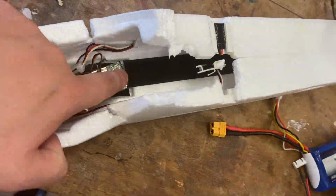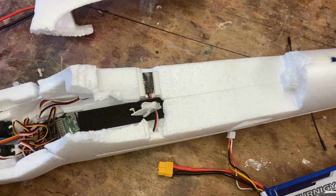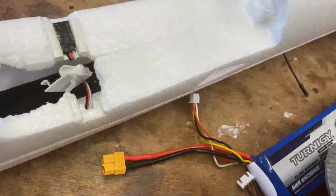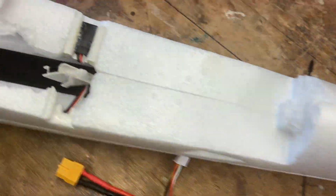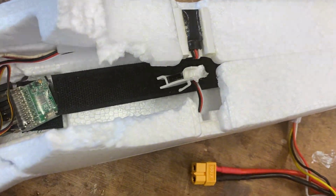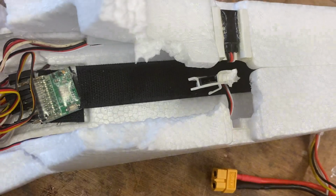But yeah, because I'm new to the TBS stuff as well, which didn't help, I didn't look and see whether I was getting packet loss. If I wasn't getting packet loss, then that means it's a faulty receiver because it's not sending the information out, or it's a faulty S-bus decoder. We could look into that. Again, I think, trying to decide what to do. Maybe I should.